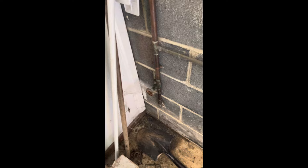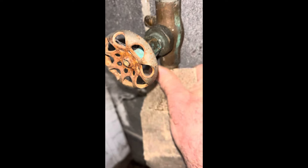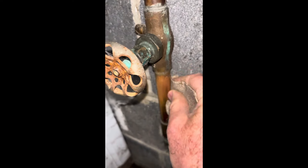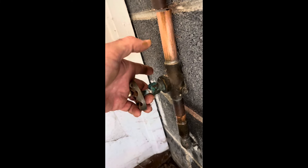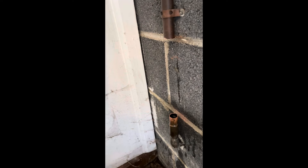You want to clean the copper off real well. We're getting ready to cut it and put in the new fitting. I'll carefully cut the old valve out, and now we'll begin putting in a replacement right there.